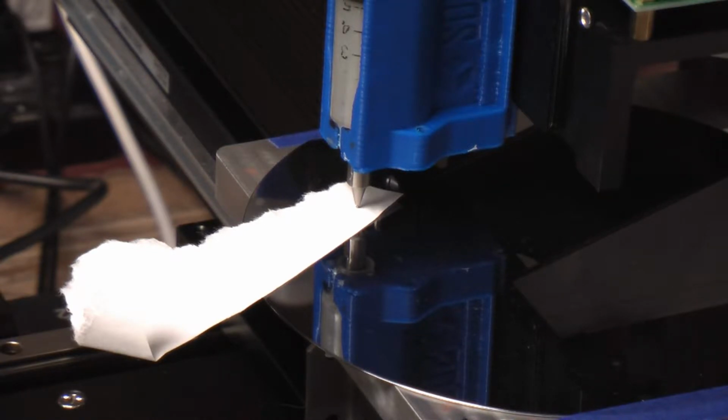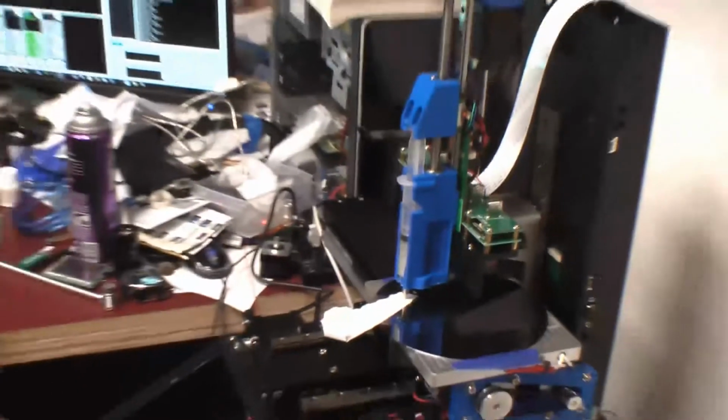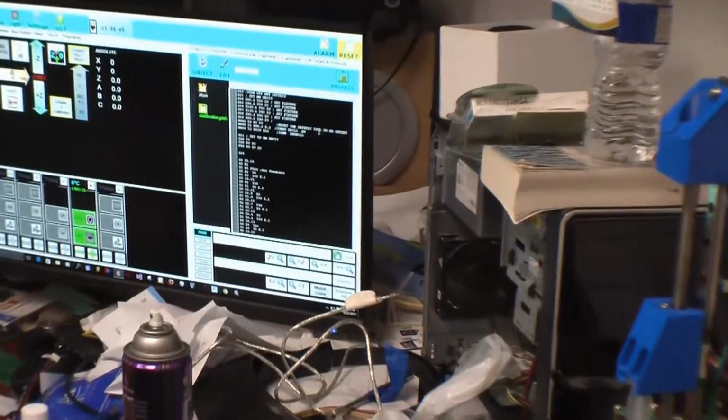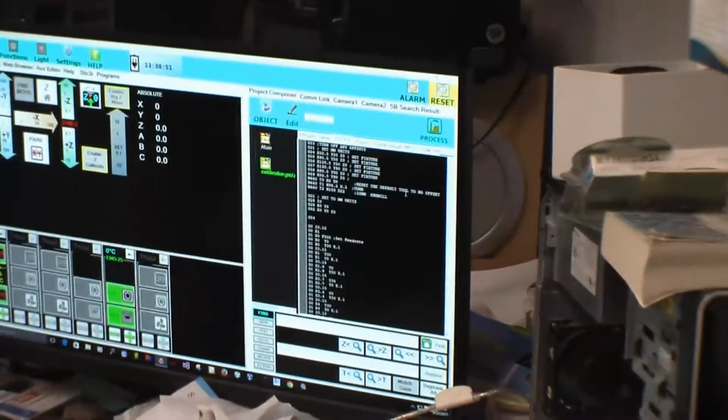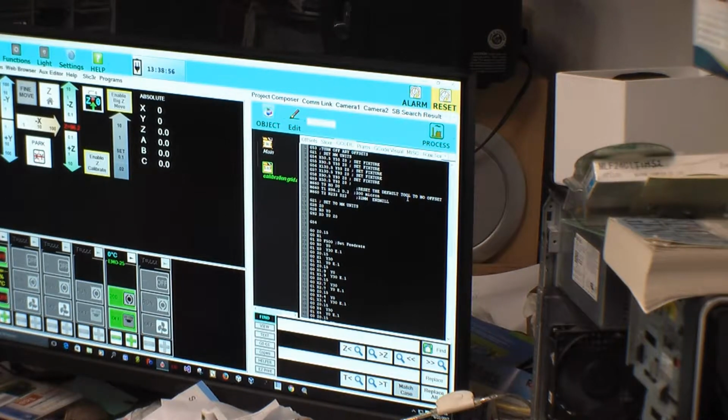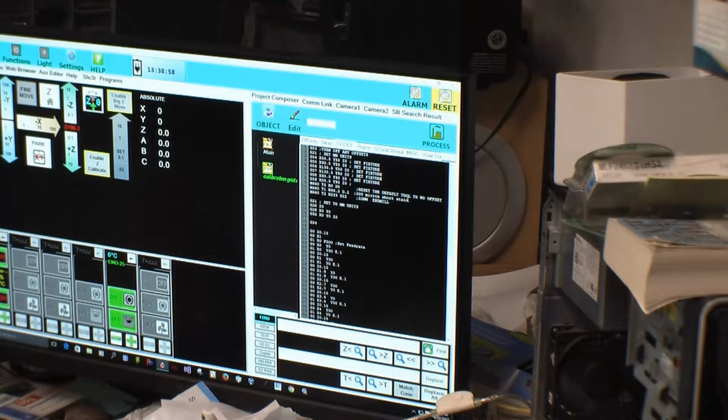Okay, so you read this number here, 96.2 microns. And so that becomes my new height for that head. This is not a combo drill, and the diameter on this is only 0.2, so you don't have to fill this in unless you start using our auto grid stuff. Okay. And it's important to note it, because the next time someone tries to do this, they want to know the setup. Right, 200 micron, short, stainless, luer tip.